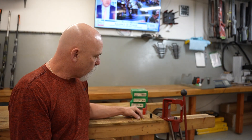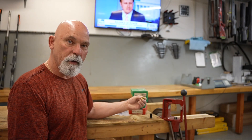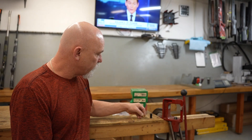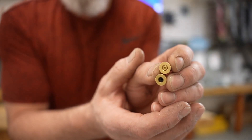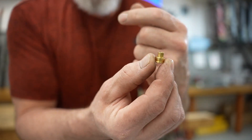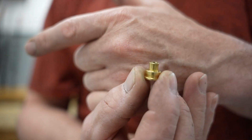We've got two primers here for a standard gun and two primers here for the .45-70 bolt face. These are the standard bolt face .308, and these are the .45-70 bolt face. We've got one that's been fired but the primer's never been knocked out — he said that will go in his breech plug no problem. We've got another one that's been fired and it's been deprimed, and he said now it won't fit in his breech plug. If you guys can look close enough at the top of this primer module, it's bell-mouthed.